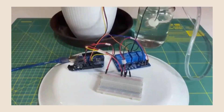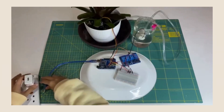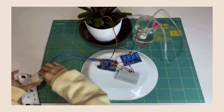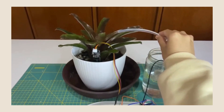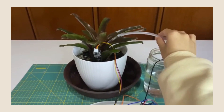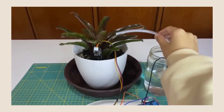Let's do the demo for the smart watering system. The smart watering system measures moisture content present in the soil, controlled by the Capacitive Soil Moisture Sensor. The sensor is placed inside the soil and moisture readings are sent to the Arduino controller. Arduino alerts the motor to supply the required amount of water to the soil. If the soil is dry, the moisture sensor values will be high, so the pump is turned on using a relay and switches off when the values reach the threshold.